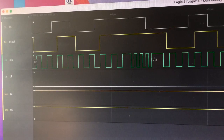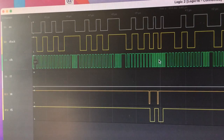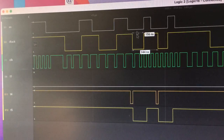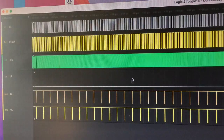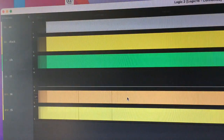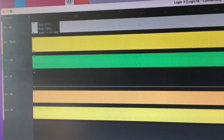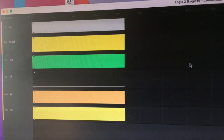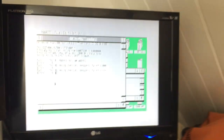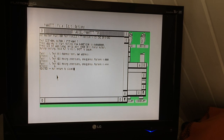And this is what basically happens. The speed goes up and down where it can. And when we access alt RAM, after the first one it runs at about two thirds speed. And then it gets into the full run of it. And you can see all of these alt RAM accesses as we're using the testing program here, YART from Christian. So we can let that run in real time, and we'll come back to that other line in a moment. We can see that that's running through. That's all very happy. No problems there.